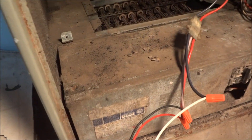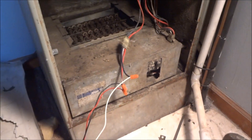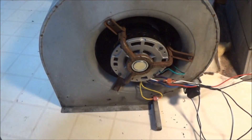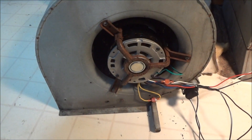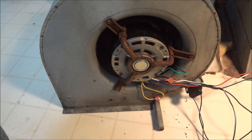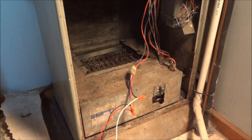It's been running for 26 years — this panel was missing, letting all that dust in. But we'll get it all taken care of. The issue was the motor. The motor and capacitor at our local motor store cost a hundred dollars — half-horsepower motor. That should fix the problem. A little bit of troubleshooting, and that's what we found out. Time to put it back together.